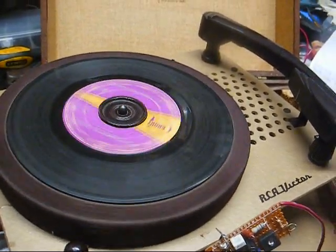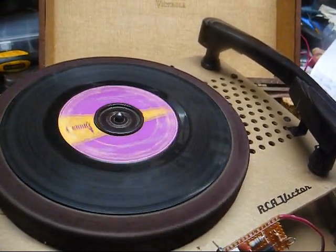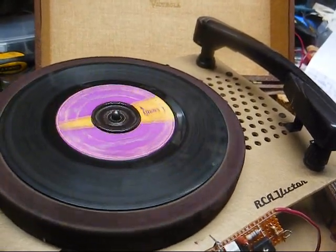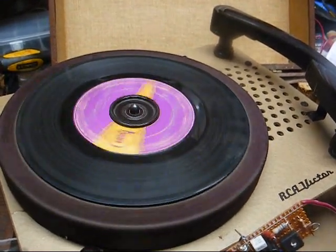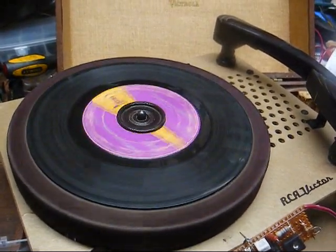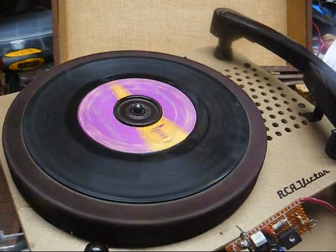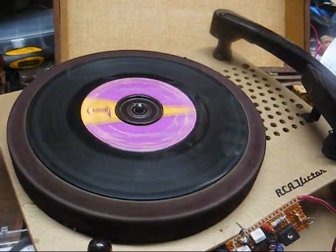But they were supposed to be an RCA distributor, parts dealer, and I called them up and I told them I want an exact RCA replacement part for this flyback. I don't want some generic something. I want the exact replacement part. Well, she assured me that's what I'd get. Well, the part came in and it was some no-name generic something in a black plastic housing that was physically a little bit smaller than the original RCA part. Well, after fiddling with the pins for what seemed like 2 hours to get them to line up on the circuit board, I installed it onto the chassis, turned the set on, it worked good.